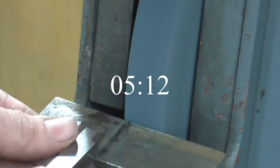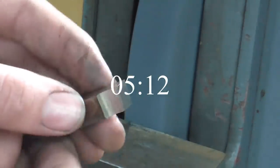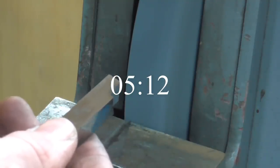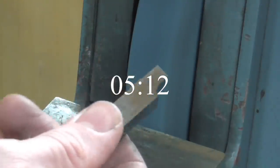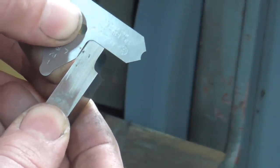That has got the worst of it out. All the forces there were going radially into the wheel and at the moment I'm not worrying about any side rake — this is just ground straight vertically. You'll notice I'm quenching in water. When I quench in water I try not to get too much liquid all over the place, as liquid transfers heat much more effectively than solids do. Particularly if quenching in oil, if you get the whole thing covered the liquid boils and it starts to burn your fingers much quicker than if you can keep it reasonably dry. Now I'm going to start producing the radius, again vertically with no rake angles just yet.